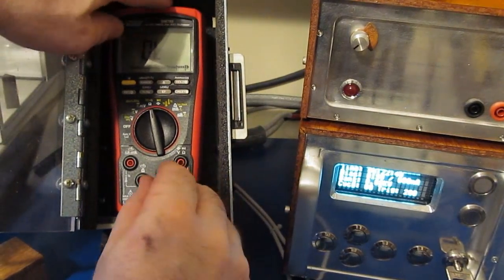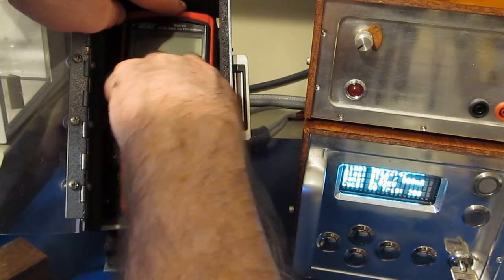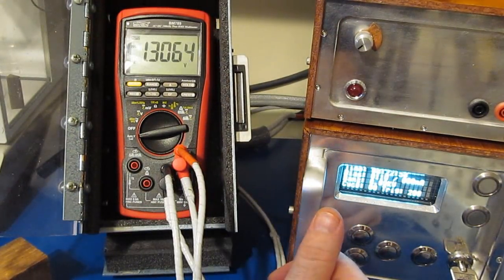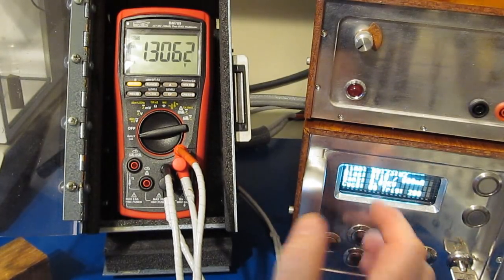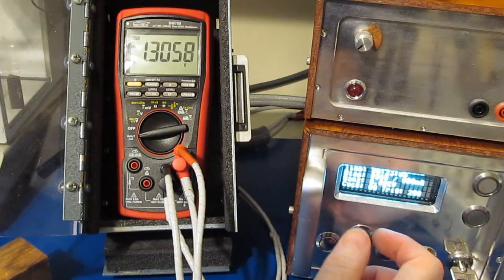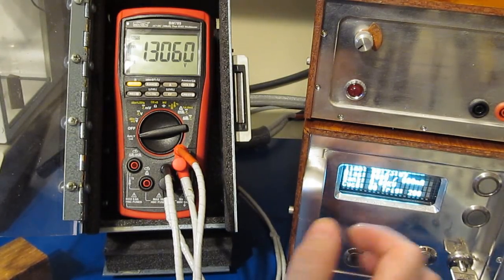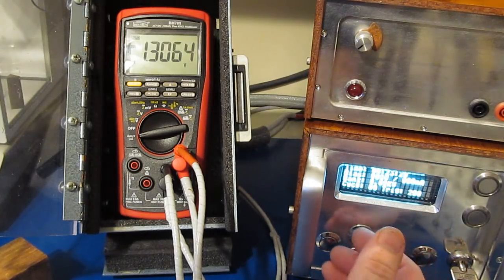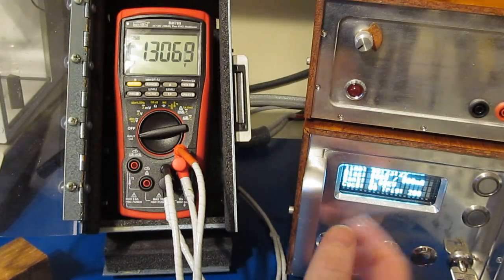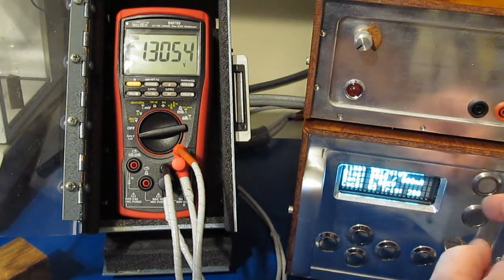We're getting close to what the generator can actually output. It's just shy of 6,000 volts. I came up with that number based on how the original $50 meters that I looked at ran. There was one meter, an Amprobe AM510, and that particular meter was damaged at like 5.8 kV or something. So I used that for the upper end criteria for this transient generator. All right, so again, this is going to be 5,000 volts peak.